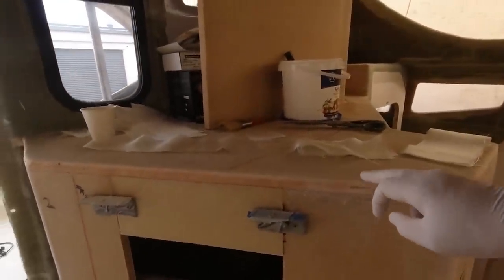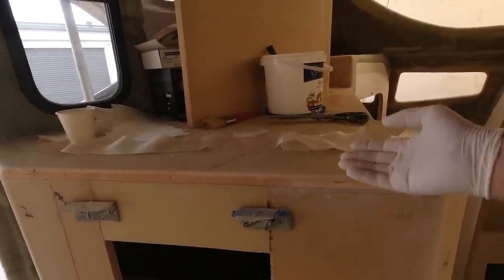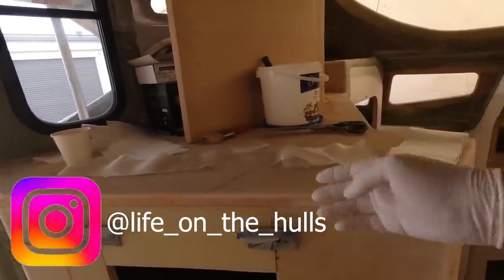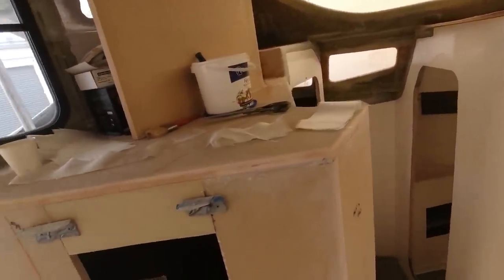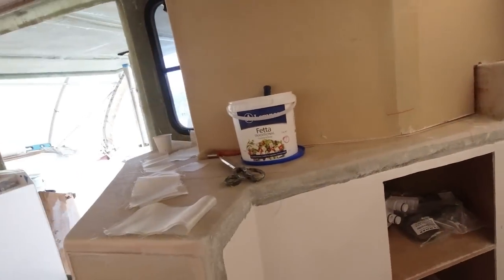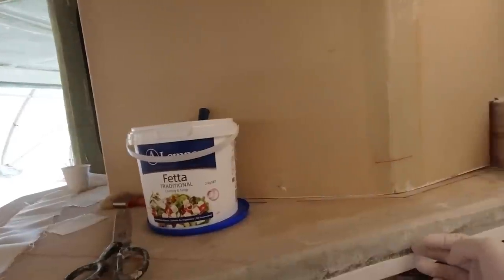At the moment it's only foam - it's pre-laminated foam core and it's glued together with epoxy. To get a nice uniform finish I do need to put some finishing cloth on it, just to get a couple of layers over the top, and then I'll be able to get in and fair it correctly and spray it. There are lots of fine edges, and Janet last week was able to laminate this.